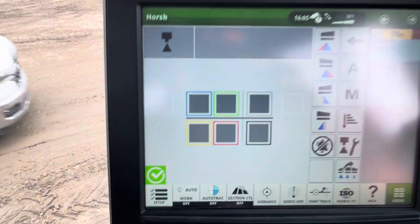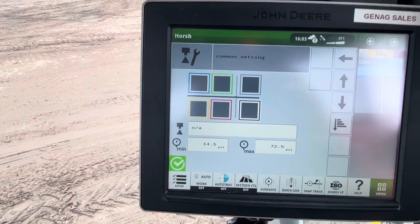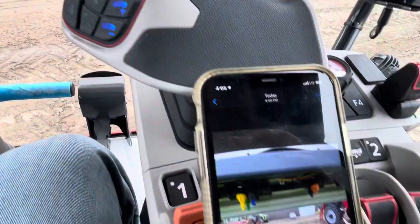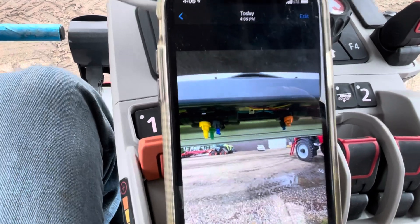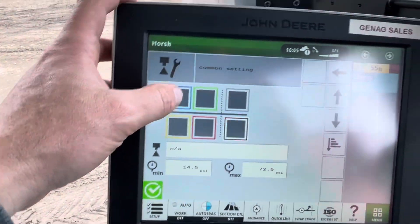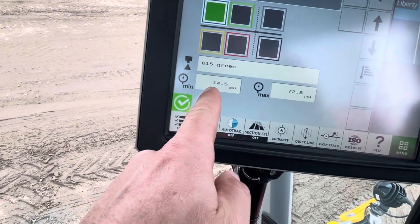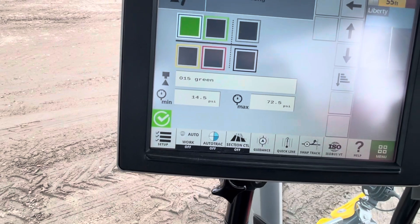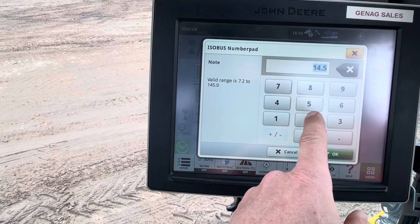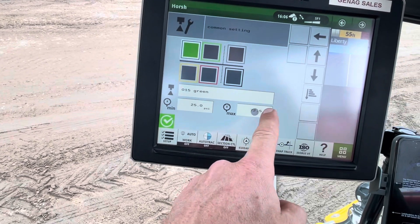It's important to take a picture so you know what numbers to put in. We'll go to our monitor, hit nozzles, go to the wrench, and tell the machine what tips are in what position. This is the four position, this is the two position. Looking at my picture, I can see the green is in the front top left corner, so I'll select that. I'll go down and pick green — it's showing minimum and maximum pressure, so we'll set it from 25 to 40 PSI.